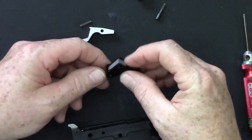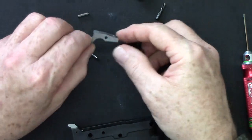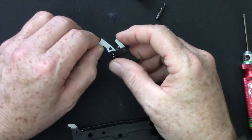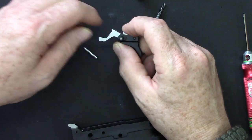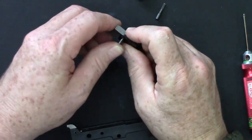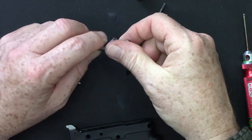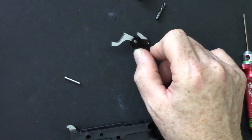So if you wanted to put your Ruger back together, you'd simply put your disconnector back in with its pin in this shape. Take your sear, put your sear spring in the hole — that spring also connects with the hole in the disconnector. Rotate them around and then put a slave pin in there, an eighth inch diameter by half inch long. Wiggle it around till it lines up and catches. You could put this back in, or you can take your kit — in this case they're identical — and install it.